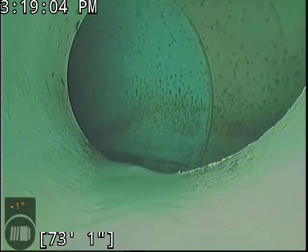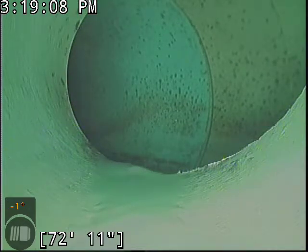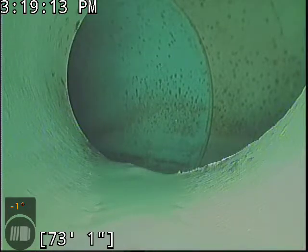Paper towels and stuff like that will create very hard blockages, and you can legitimately get a backup from that distance. Otherwise, regular toilet paper, human waste, and the proper food going down the disposal is unlikely to cause a backup from that distance. If that belly were right next to the house, one of that size there, it'd be a little bit different story.